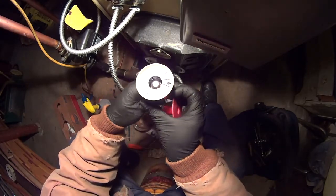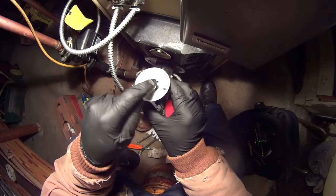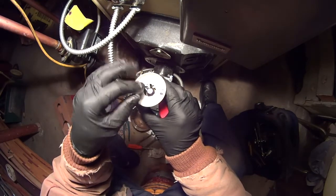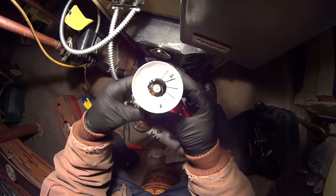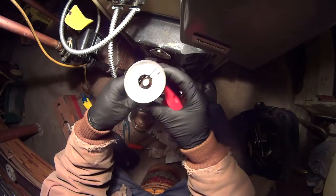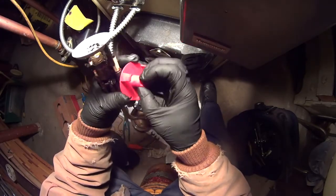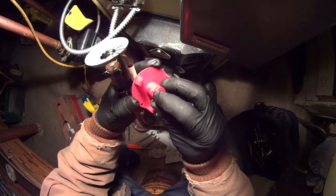You see those — that's where the spark goes across: 14,000 volt. Goes across and then, like the air, just blows a little bit of spark out and heats that oil coming out. That's how the fire is, that's how the flame goes in. And this is what's making for that — you see that little tip over here, you can see the little tip there, so it's gotta go in between.